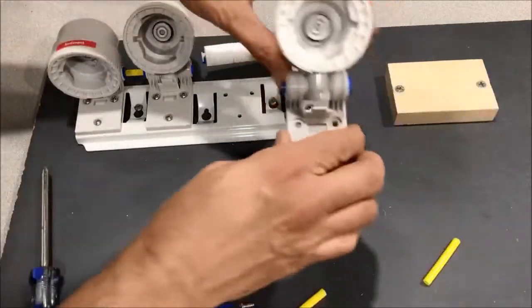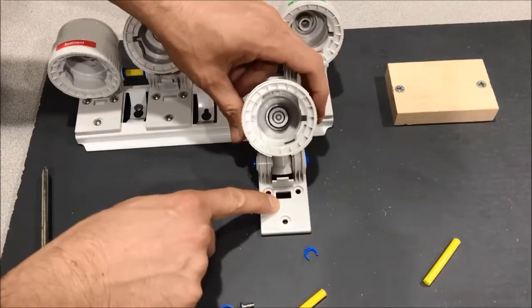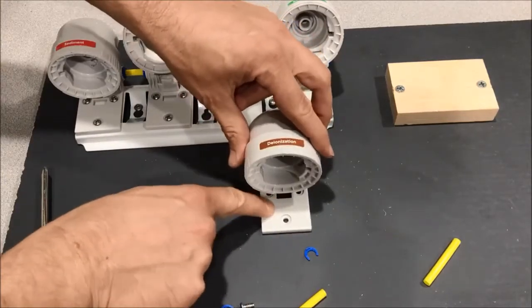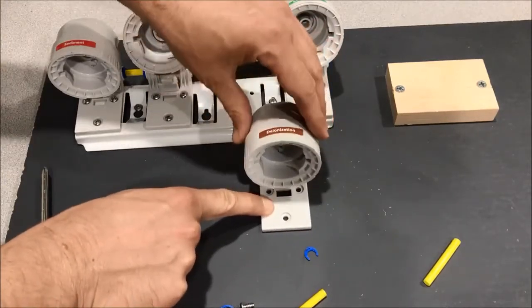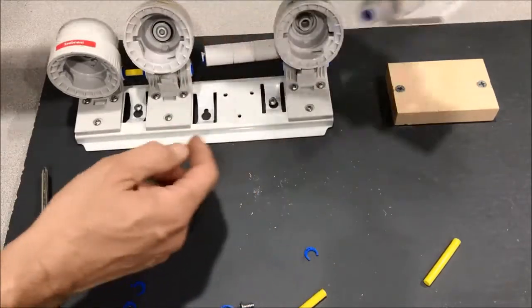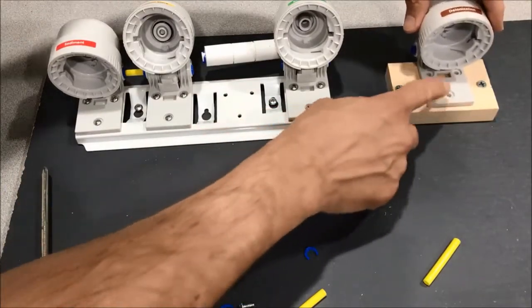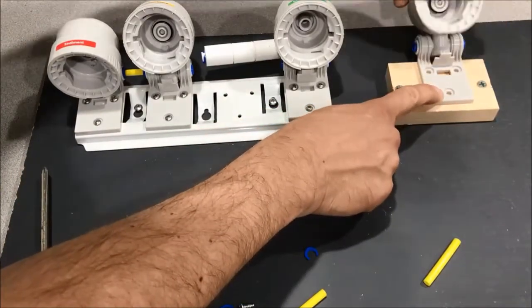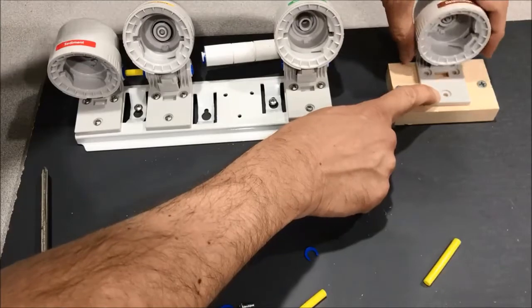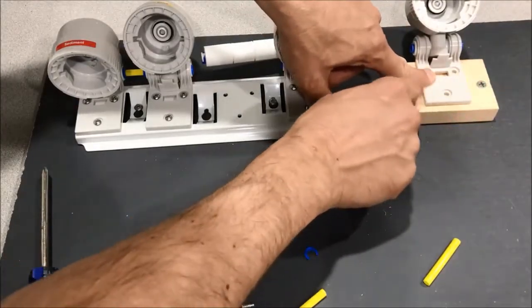You would think that because each one of these heads comes with three screw holes you could just mount it right onto your board. But the problem is, once you mount it, it won't allow the head to tilt up. So we have to raise the head — that's why the bracket is raised. Here we've just mounted a little piece of wood, but that will allow the head to pivot up and down. You're going to want to secure your last DI head to a raised block.